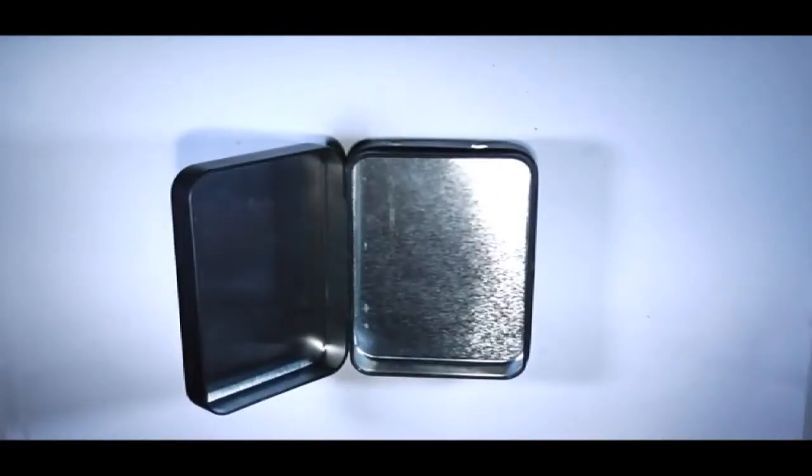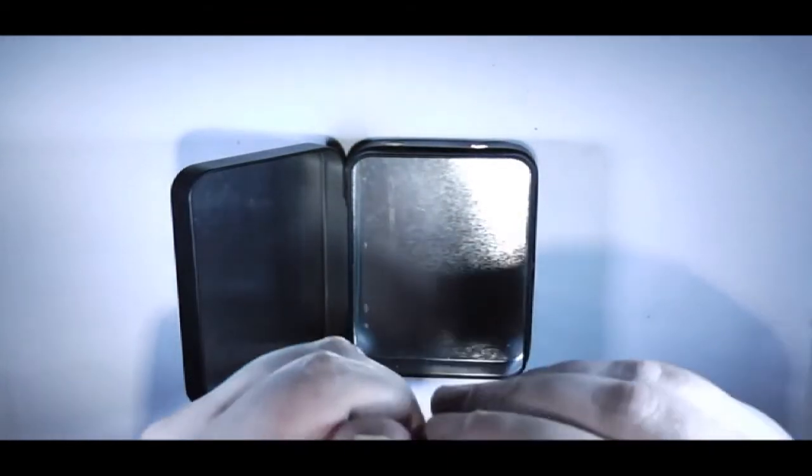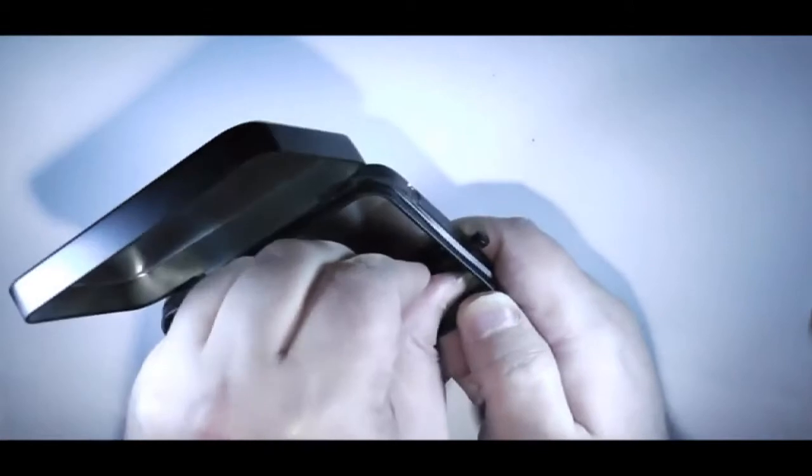So we have our two holes cut out and cleaned up a bit. So that one is just sitting there nicely, flush with the unit. Probably sealed in with a bit of epoxy putty, I think, just to build up the strength, because all you've got to hold it in place basically is a very thin piece of metal. And this switch, because of its design, should be simple enough just to slot it through.